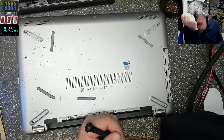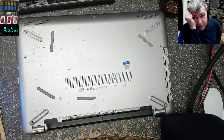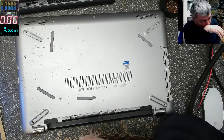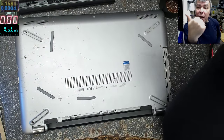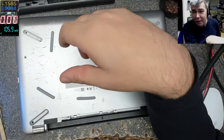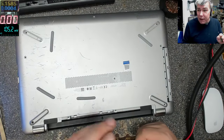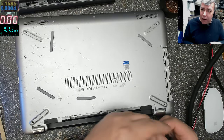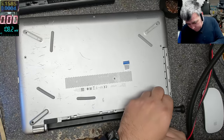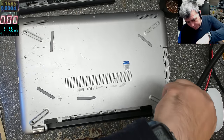You'll not understand, but we spoke about that. We spoke on the power supplies, on the switching power supplies. It's hard to explain, but don't worry, if you have this job, you can remove the capacitor. You still have one or two there. And if you don't have one or two there, the next power supply will have, yeah? So whatever is escaping from that power supply will be shunted to ground on the next one. Okay.